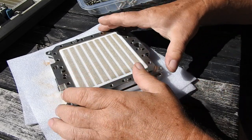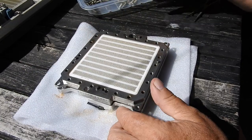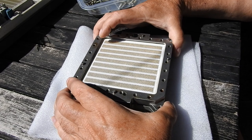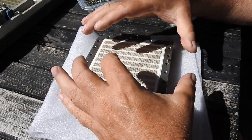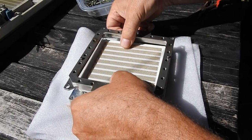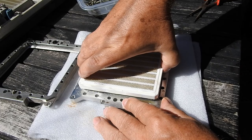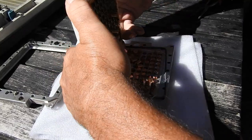I've transferred all the pistons across, and now I'll show you the correct way to disassemble this. After removing the cap screws from the bottom, turn it over so the pins are facing upwards and then remove the top of the module. Notice how it comes away from the ceramic substrate — it may not always, and if it lifts it the ceramic may then drop. Best to make sure the ceramic stays down while you lift it off. It's a little bit sticky because of the oil; give it a slight twist and it should come free — though some pistons still dropped.